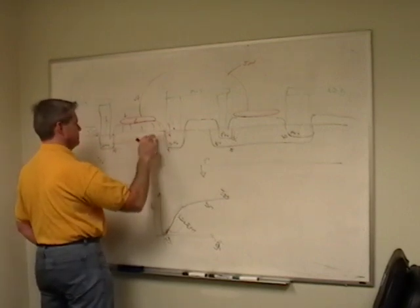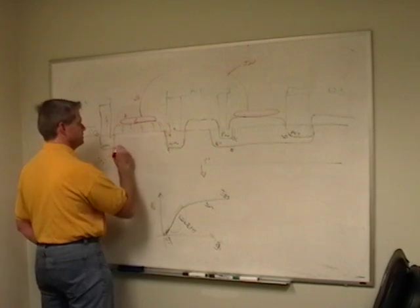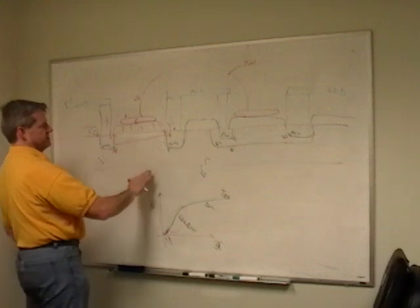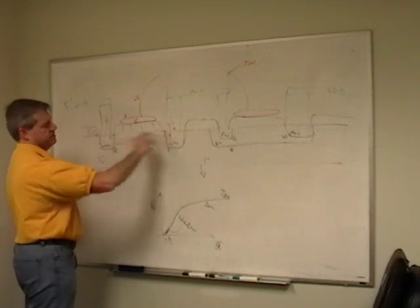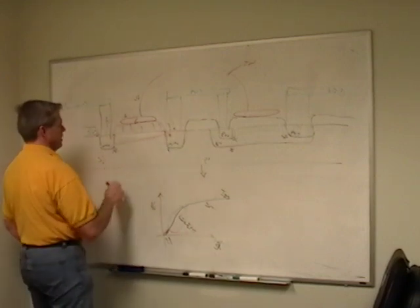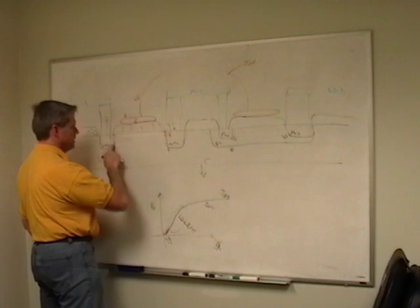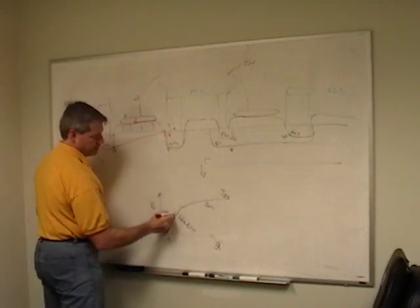This becomes positive, these electrons want to pull in. This starts to get a slight slant to it. Because as I'm pulling this positive, these electrons that are coming up through here, these leakage electrons, are sucking in there. And now I'm moving up my linear region. And I keep going here. Now I'm working my way up the curve.